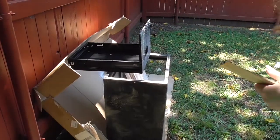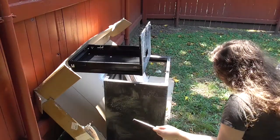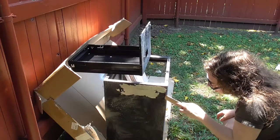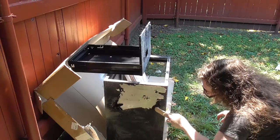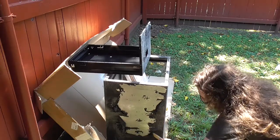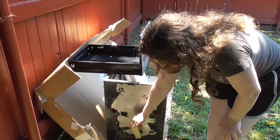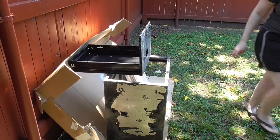There was actually a part before this that you didn't get to see — while I was dismantling the filing cabinet, it had quite a bit of rust on the bottom. I used vinegar and a wire brush to get all of that rust off, or at least as much as I could. I did end up putting felt feet on the bottom so it wouldn't scrape up against my floor. On projects like these, especially with metal, any rust you leave on will degrade what you're working on over time, so it's really important to get that rust off.